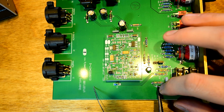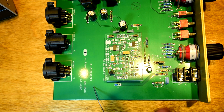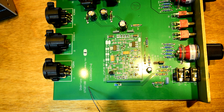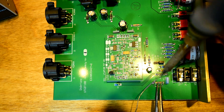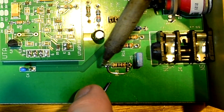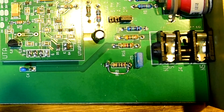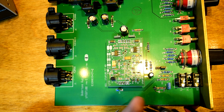I'm going to hook it over the resistor, and I'm doing it on this side since it's the open side of the board. It will be easy to work on, and if we ever need to remove it later it'll be pretty easy to do. We want to make sure we solder this in really nicely so it won't jiggle around. The guys at Undertone actually recommended doing this on top of the board rather than the standard — remove the component, use the solder sucker, replace with a straight wire. So I took their advice and I'm doing it over top of the board with the jumper. You just need to add a little bit of solder, not too much, and check your connection with some pliers to make sure it's not going to jiggle around.